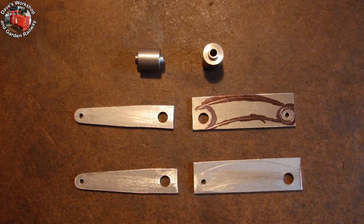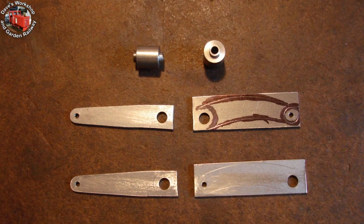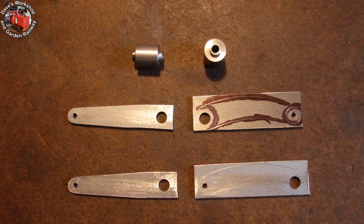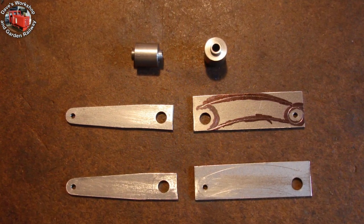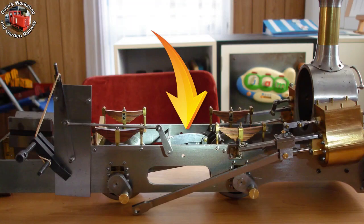The pieces for the two new lifting arms: the outer will be curved for aesthetic appeal, but the inner cannot be, otherwise it will hit the boiler barrel. The first one is complete. That curve was scribed using the base of a handy tin. The three parts were held together and aligned using a threaded spacer for the brazing operation.